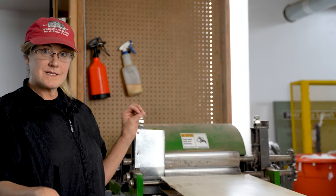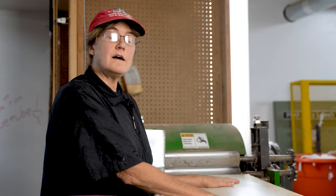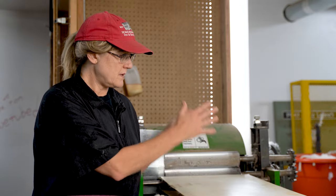We do use a spinning conditioner because down here at the mill we are constantly battling static. We try to keep it about 70% to 80% humidity, but especially in the wintertime it's hard to get it that high, so the spinning conditioner helps with static issues. This is also the stage where we do a lot of blending — say we're doing a 30% blend with Angora Rabbit and Romney Wool. We would have our two fibers weighed out and ready to go, then alternate them as they go in, and the picker blends them together so they're ready for carding.